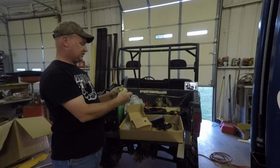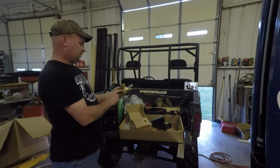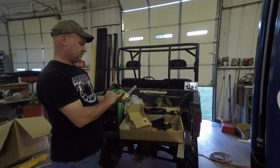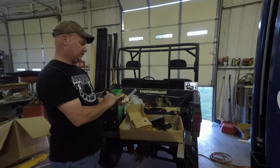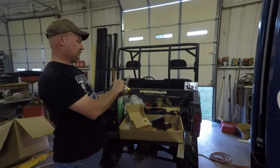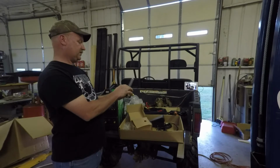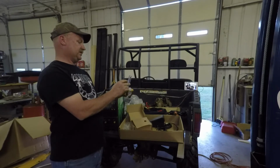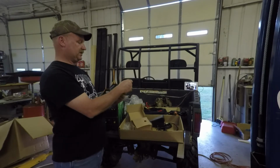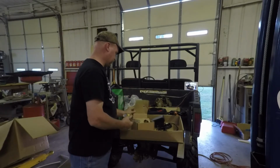I don't know what you set it on. I don't know, this pressure may just show what's in the bottle. I bet it does. I really don't know on that, come to think of it. But you set this part here to, I think, about 15 cubic feet per hour. And this is in standard and not liters like somebody had said. The older ones, I guess, used to come with liters.